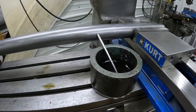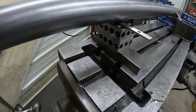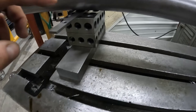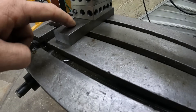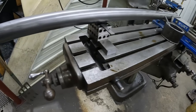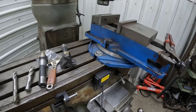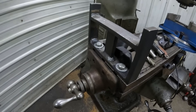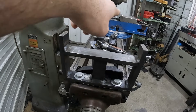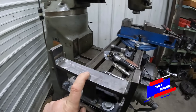You want to use a center-cutting end mill. One thing you need to do when you're doing this longer stuff is be able to support it. I didn't need any shim stock — just a parallel, a couple of 1-2-3 blocks, and a piece of three-quarter-inch cold rolled to support it, and that came out perfect. On the other mill I have this old junky vise, but I have a bracket I built that stays on the end of the table, machined to the height of the vise, so it works extremely well to support the bar stock when doing longer stuff.